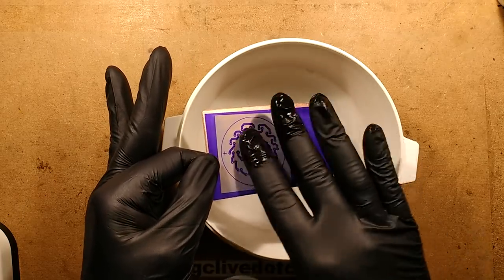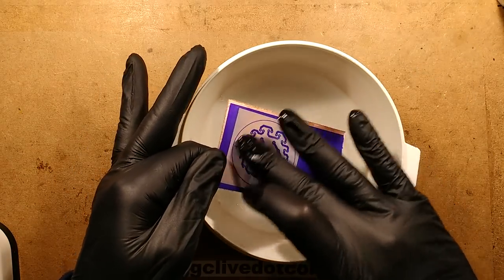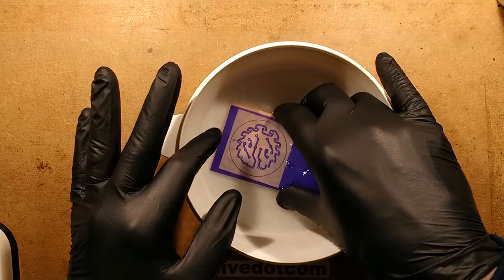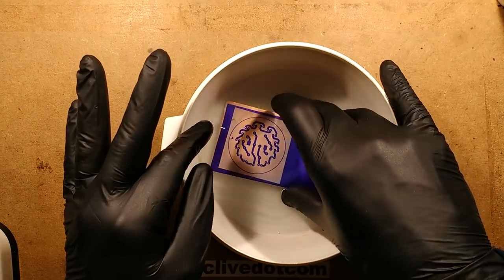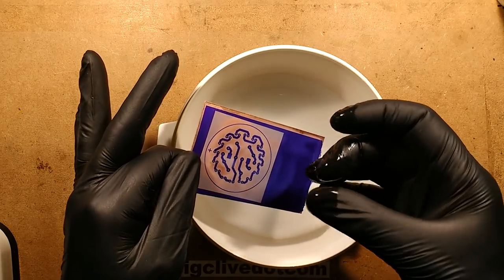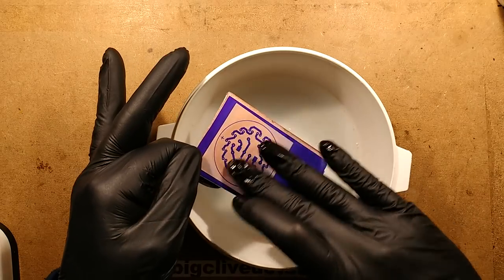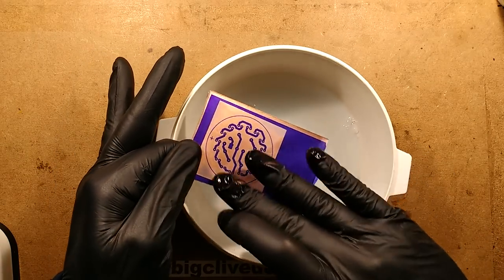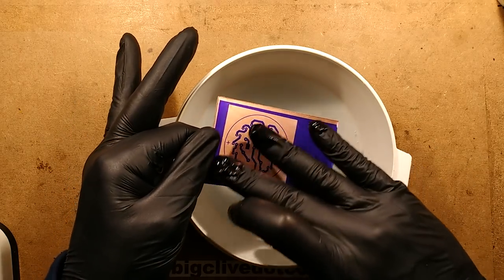A soft brush — nothing too sharp or bristly because otherwise you might damage the material. Keep soaking it in the developer and you may see it's actually changing colour, the layers are coming off, exposing the copper underneath. I want to give particular emphasis to clearing the pads — especially the holes in the middle — because I prefer to have the indents in the middle fully exposed and etched out as it makes drill alignment a lot easier. Also, make sure you clear between the pads where the two pads come close together, because a little light tends to seep during exposure and it takes a bit longer to develop in that area. Even the thinnest invisible trace of etch resist means it simply won't etch at that point.